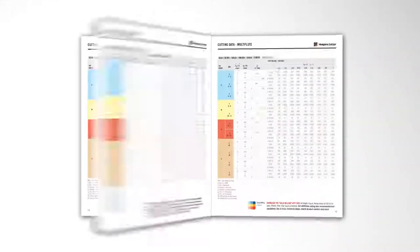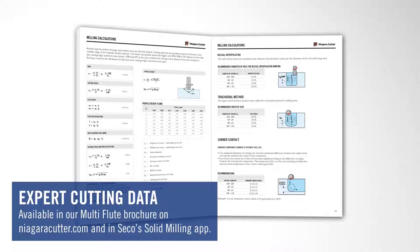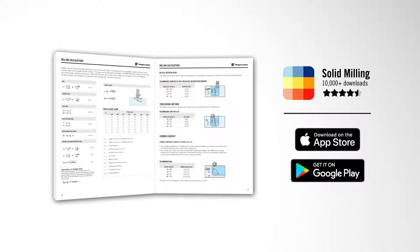Along this journey with optimized roughing, we've learned that certain cutting data needs to be applied with these strategies. If you're utilizing a six, seven, or nine flute tool, we've figured out exactly what speeds and feeds you need to run those tools at, whether it be for steel, stainless steel, titanium, or inconels. In the back of the brochure and also in the solid milling app, we've taken all the guesswork out by already giving you that information — it's a really good place to start. Depending on your application and machine tool, you might have to optimize from there and dial the parameters in a little bit, but if you're new to optimized roughing, look at the resources that have already been developed.